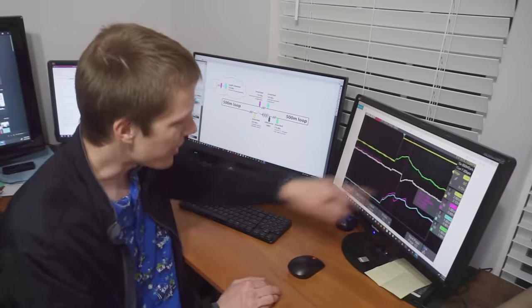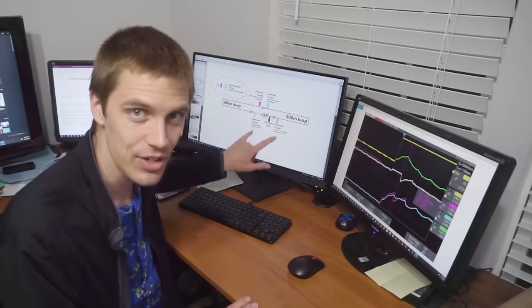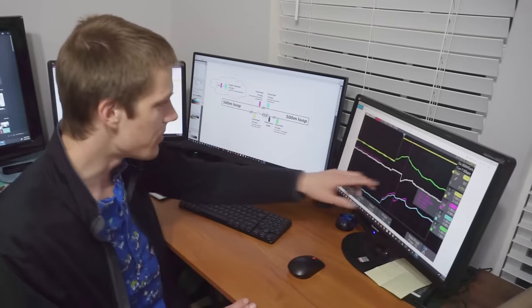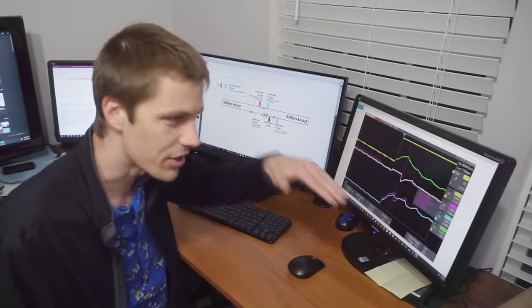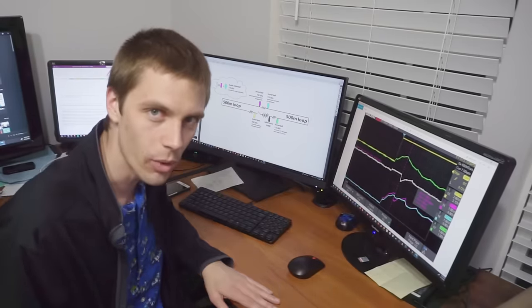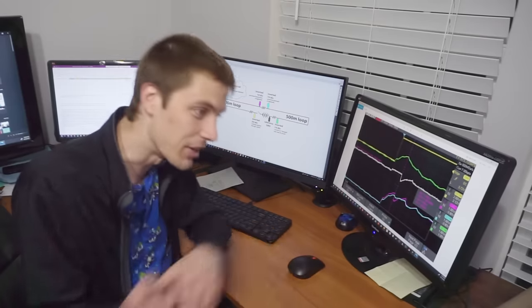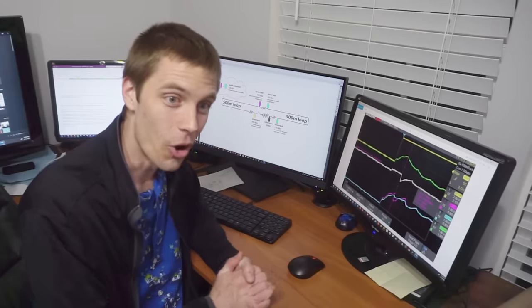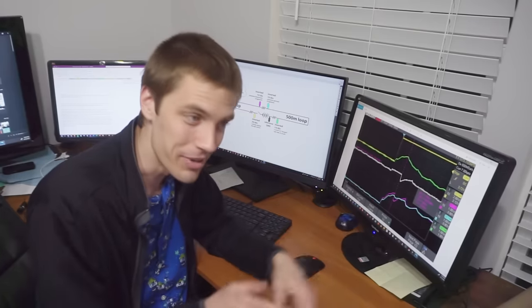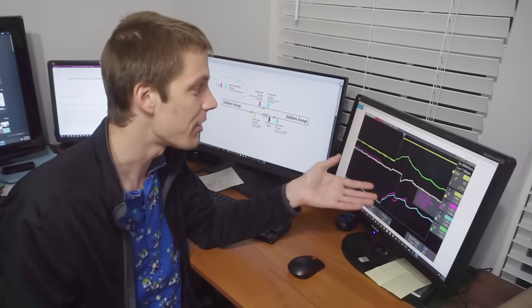So this green trace right here is showing the current through one of the resistors that's right next to the battery and switch. And that says that there's some current flowing at the beginning, but then that current actually sort of dies off after a while. So here we have the battery tirelessly pumping electrons from one side to the other, except eventually all those electrons pile up. Because we've cut the end of the wire, they have nowhere to go, and the battery stops being able to pump electrons.